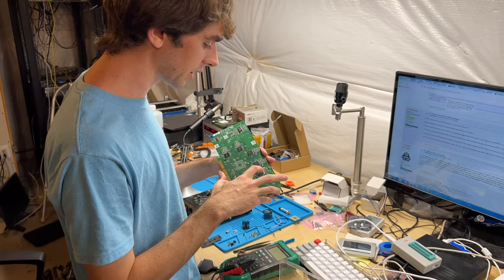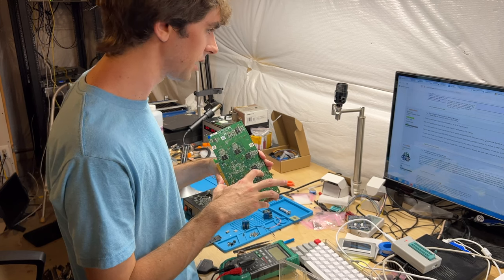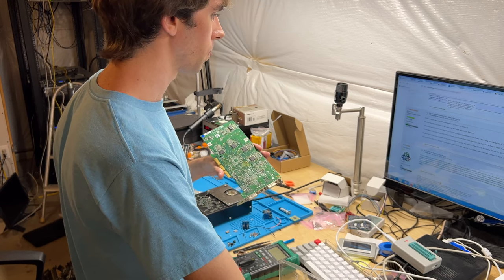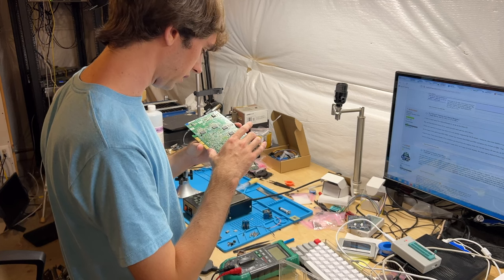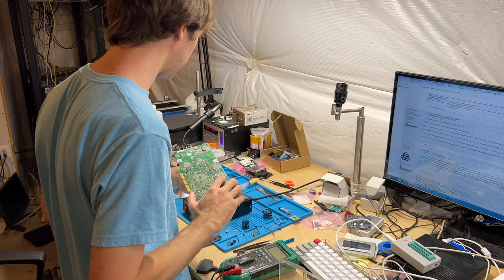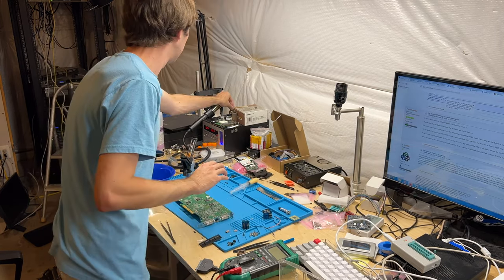Awesome. R963 is selected, R961 is empty, R962 is empty. So it says remove 963 and 961 and set R962, so we'll do that. So put 963 on 962 and we're done. Yeah, in theory. In theory. Let's try it out. Let me make a preview for that.